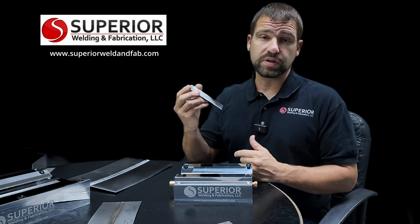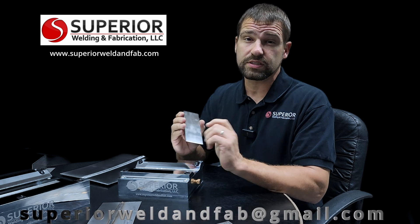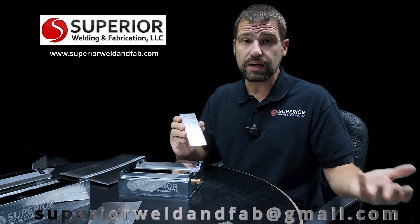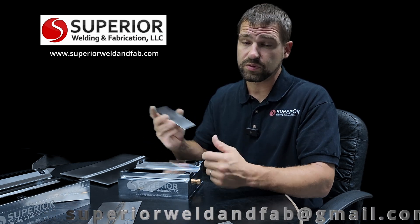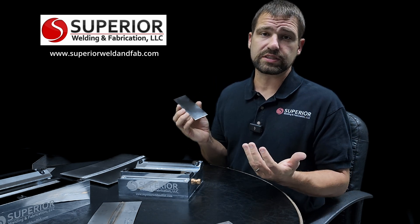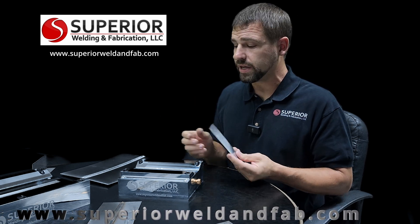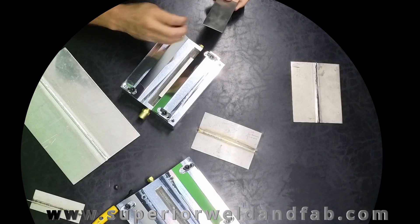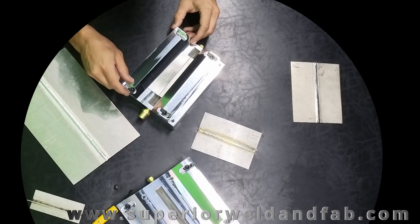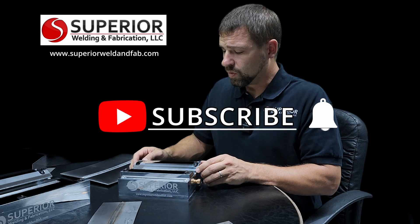Let's go over some common setup features. These fixtures are pretty universal — we've made them to fit most needs across different thickness ranges, from 10 or 20 thousandths all the way up to three-eighths, with common use from 0.063 to 0.125. Here we've got some 0.060 stainless as an example — two inch by five inch, great for welder qualifications. I've already got one piece sitting in here, we'll put the second piece on, set them in the fixture, bolt it back down, and you're ready to weld.